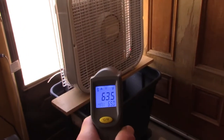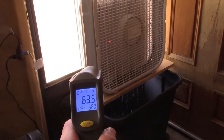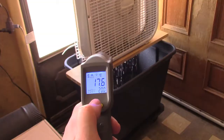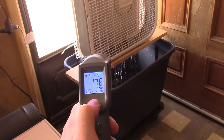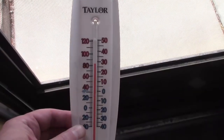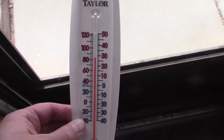Sixty-one, sixty-four. Awesome. Those are super numbers — sixty-three to sixty-eight, seventeen-six to twenty Celsius. There's your outdoor temp; that's the air coming into the fan. Eighty-four in, sixty-four out, roughly.